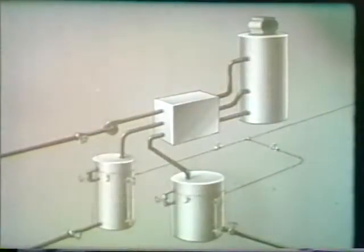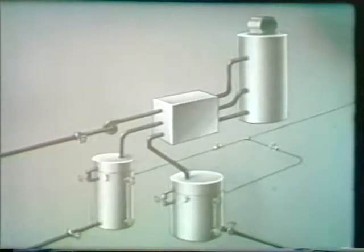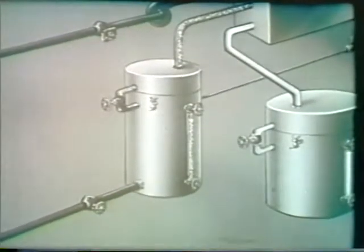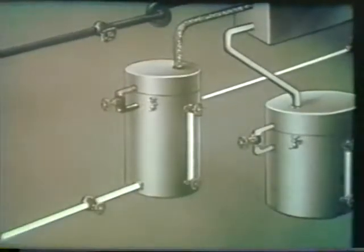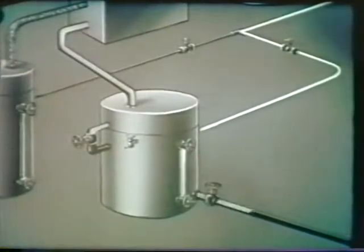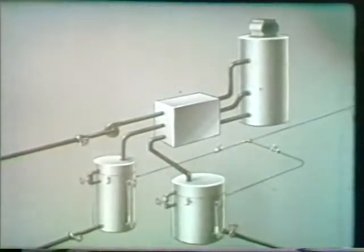In surface ships, pumps move the discharges. In submarines, gravity flow moves the discharges. The brine collects in a tank, and at intervals, compressed air blows it overboard. In a similar manner, the distilled water collects in another tank and is blown to storage. The method of handling the discharges is the only difference between submarine and surface ship units. Otherwise, operation is basically the same for both. This concludes the description of the flow system.